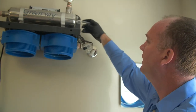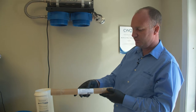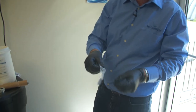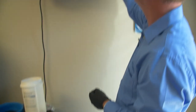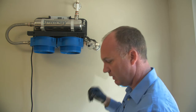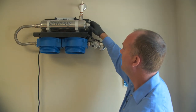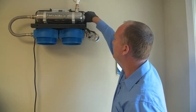We can reinsert it — it has fingers back there that it just pushes into. I have my new bulb. This one is a 330S, as it's a standard output bulb. Remove the two ends. Inside the container, there are two new O-rings that come with it. Those O-rings are what holds the water back from coming out between the canister and the quartz sleeve. So I put my new O-ring on there. Next, we put on the view cap and the knurled piece and screw that on. I generally go only hand tight — if you use tools, sometimes it's too tight, so I just give it a good crank hand tight.